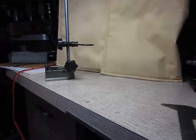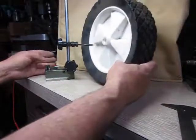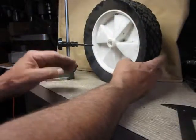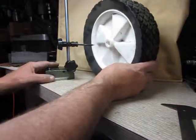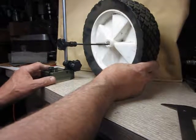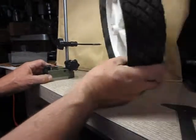On top of the metal, I'm going to put plywood so that the machine doesn't vibrate. In this part of the video, I'm going to demonstrate how to do an accurate hole layout so that before you weld anything, you've got holes drilled for your axle that match up correctly to your wheel. I just happen to have a 9-inch wheel. The idea is you want the wheel to be sitting flat just like it's a dolly. I have this marking gauge set to exactly 4 and 1/2 inches, which is dead center for a 5/8-inch axle.